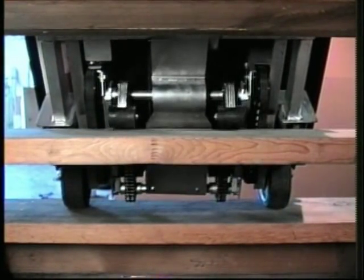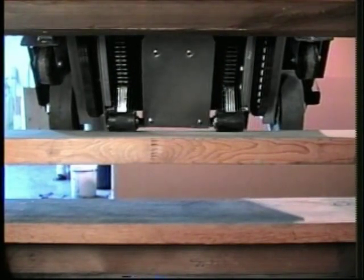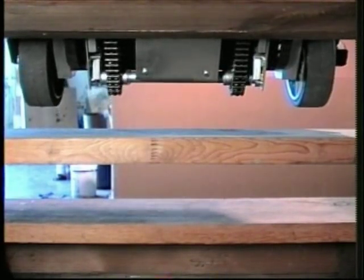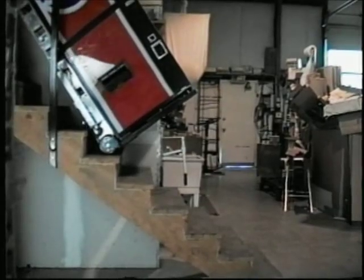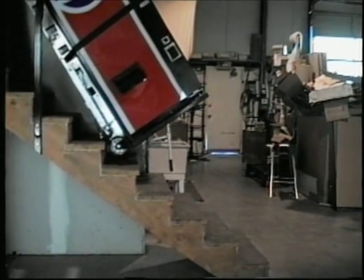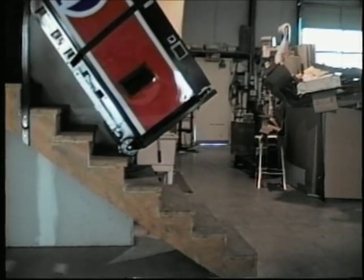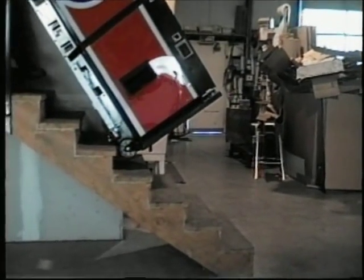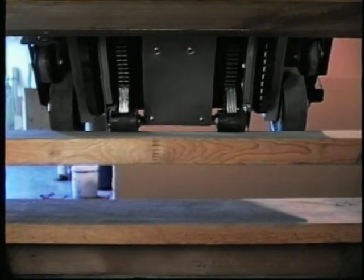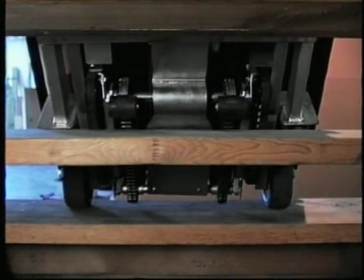With this view, you can see on the right and left sides the glide belts, which just protect the step. The dual lifting cams lift the big wheels over and set them down gently, and they come around and go up the next step. Going down is just the opposite — the cams lift the wheels up, over the edge, and you're on your way down. Again, the glide belts contact the step and protect it.